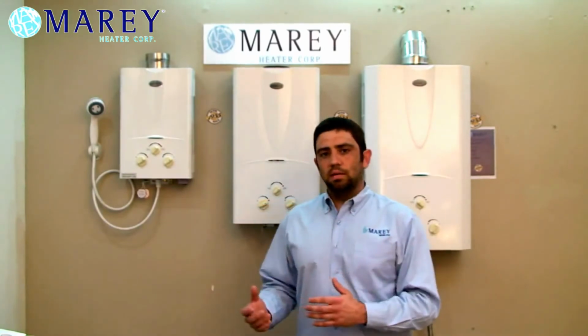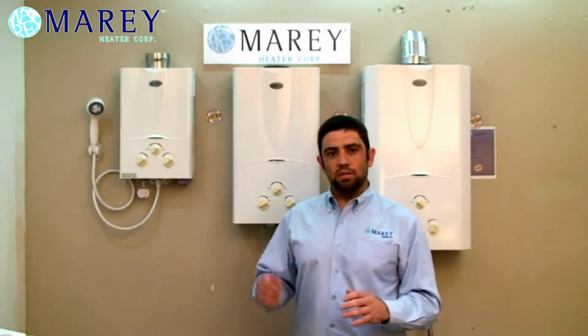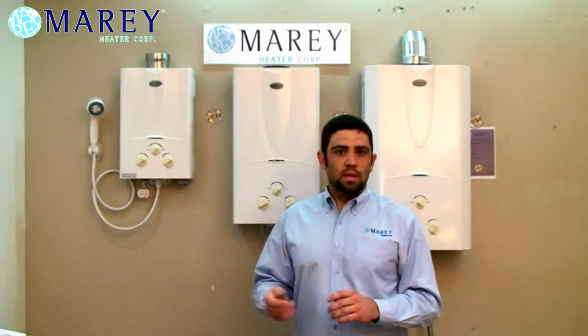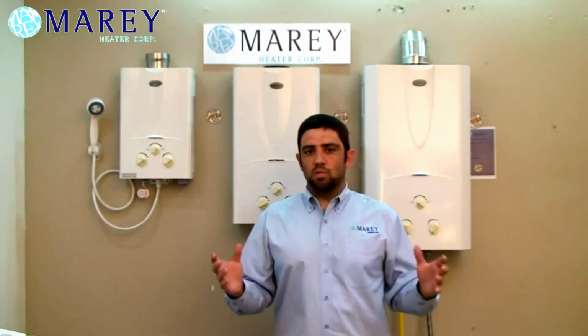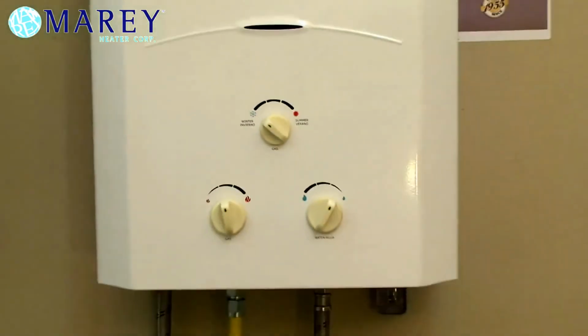These are on demand. These are endless hot water. So what that means is that there's no water being heated until you turn on that faucet and this unit is ignited. And so when that happens, you're only heating the water for this brief time that you're using it, instead of having this reserved hot water that is constantly being cooled by the air around it.